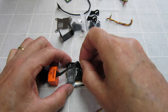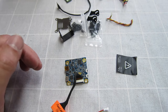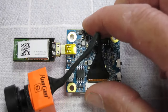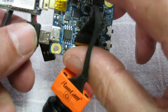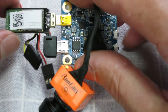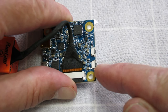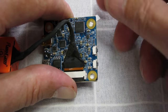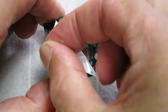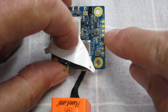Let's have a closer look — I'll take the sticker off. There's the little WiFi dongle that fits into the connector there, and the micro USB. There's a bit of a clash between those two, but you probably wouldn't use them at the same time. We have the two buttons here: the WiFi and mode-changing button, and then the start/stop button for flipping through the menu. Turn it over and peel the sticker back — these are the pads that you can solder whatever connections you want onto.